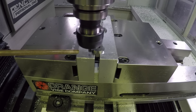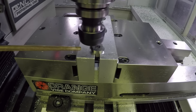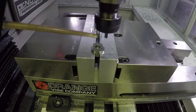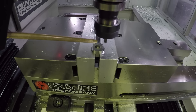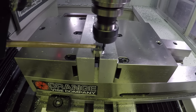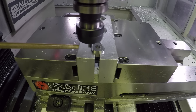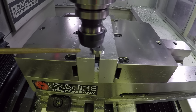I'm actually excited to see how the diamond drag tool — which I really love, one of my favorite tools — scores the tool steel at all. Here's a cleanup contour — only 100 thou tall, so we're not holding on by a ton when we go to use these Versagrips. We could make a new set that are taller. I don't think there's any real constraint there.